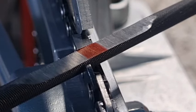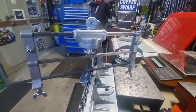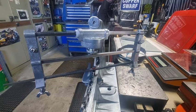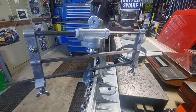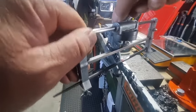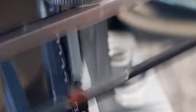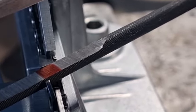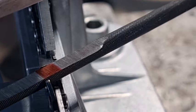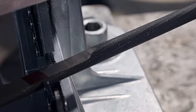I've got five degrees tilt on that as well. For those not too familiar — that's just a little bit of tilt. Because I feel this is a Stihl RS chain and the file lays in there — I think it lays in there better. If I put it back to zero degrees, can you see how the front of the tooth sticks up a little bit? But if I tilt at five degrees, it just seems to lay in there much better.